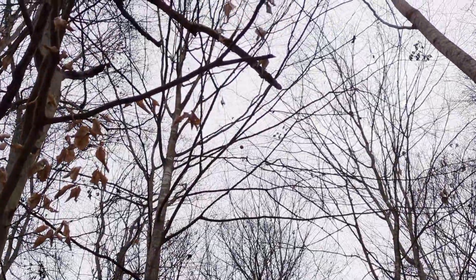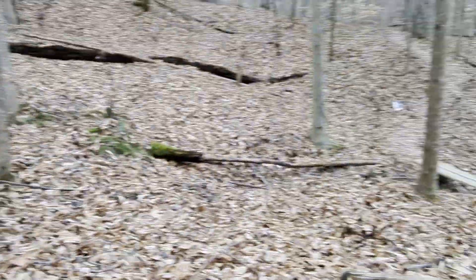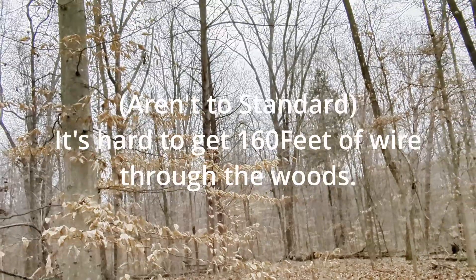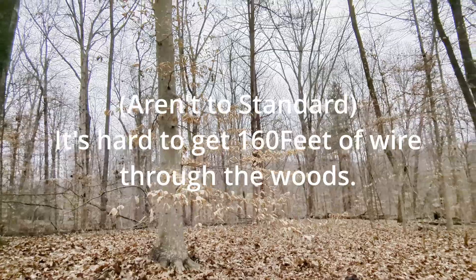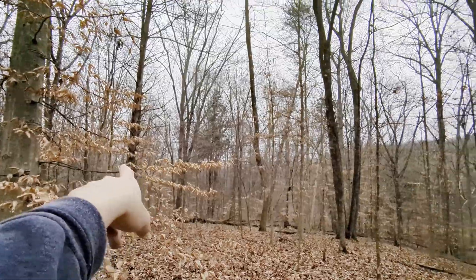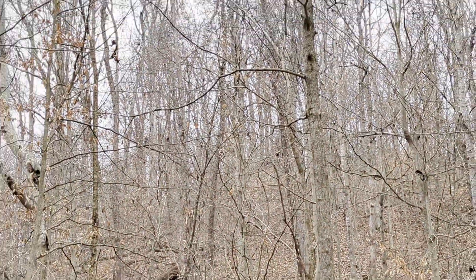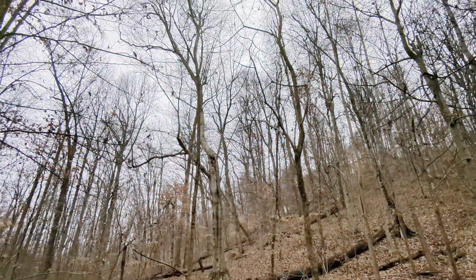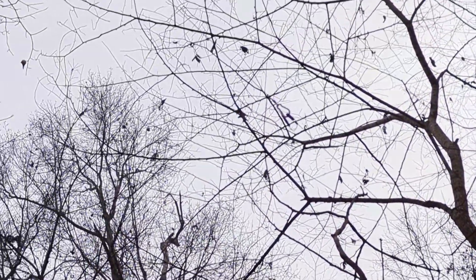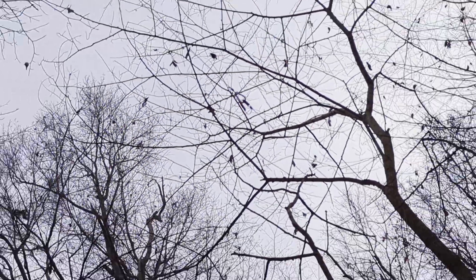All right, we were able to get it up pretty high — I'd say more than the recommended 25 feet, probably 30 or 35. There you see the unun kind of sitting up in the lead, and right now the wires are just dangling across the ground, but we're going to go ahead and take the 80-meter element over there, connect it to the end, and get it extended out. Real-world results aren't always pretty, but we got the transmission line thrown up. It's green — tactical, but you can't see it. It ties off up here in the tree and comes down, and our transmission line is right here in front of us, basically invisible.